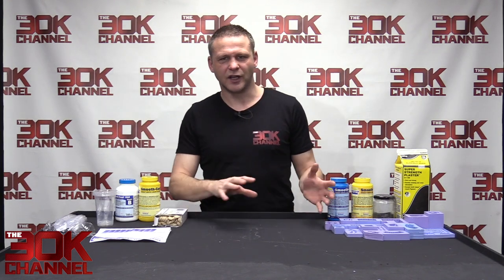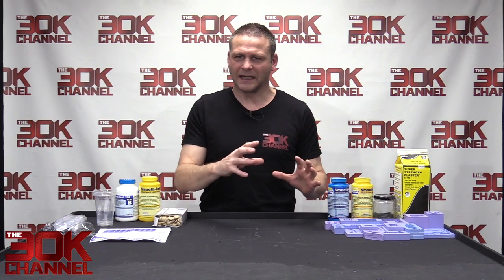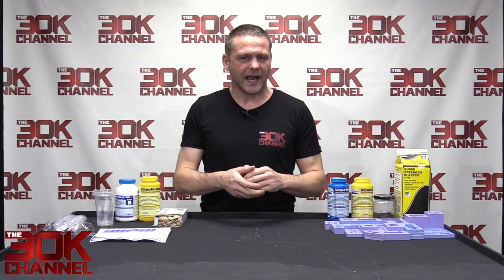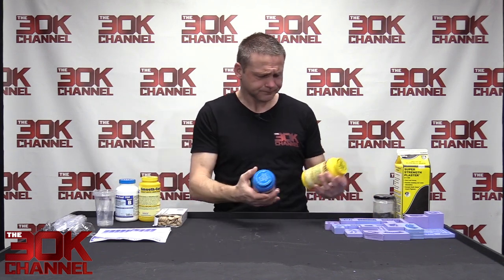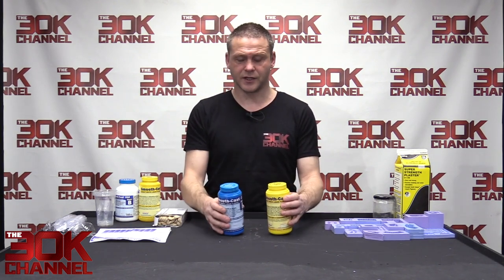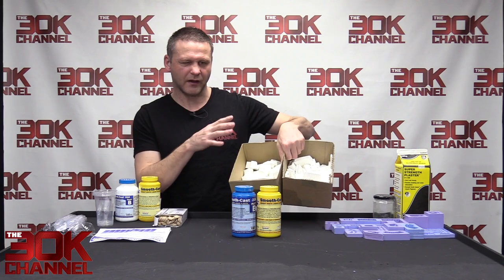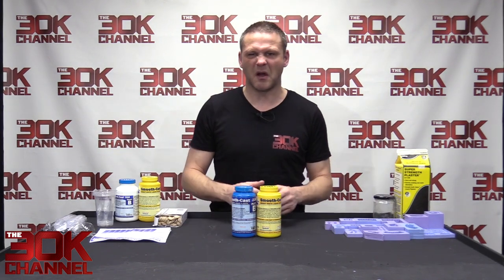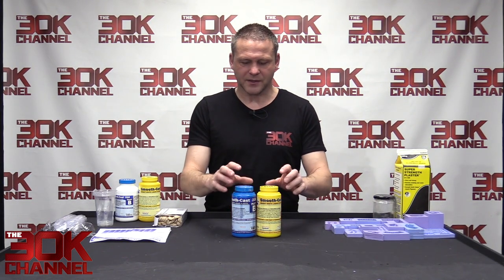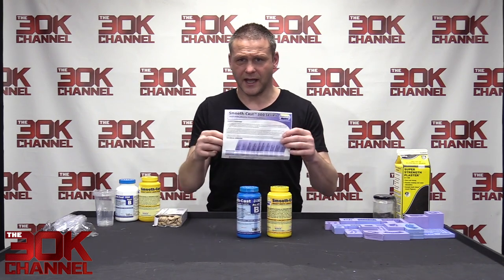There are a couple of things I've learned over the last week. The kit I ordered from Bentley Advanced Materials came with two packs — a silicone component and a resin component. The resin I ordered was Smooth Cast 300. I cast all these bits in an afternoon — probably four or five pours per mold over three to four hours — because this stuff cures in about three to four minutes.